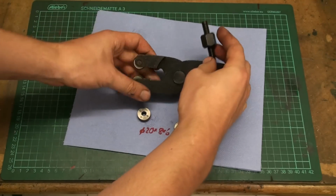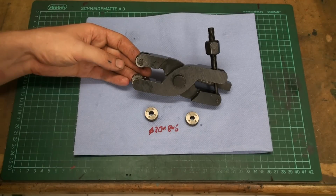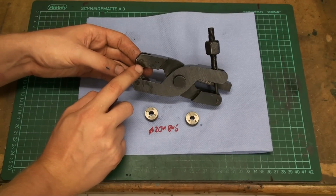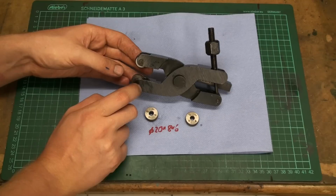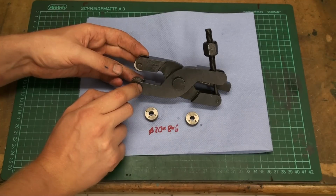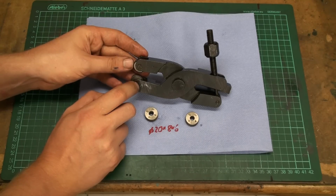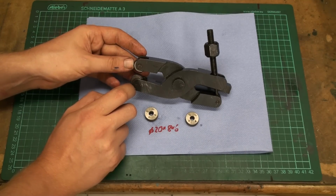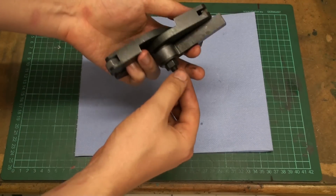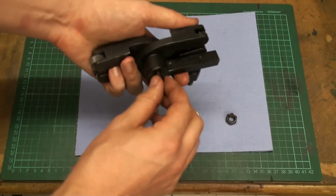The pins for the knurling wheels are pressed in, and they look like they're knurled themselves and then pressed in. Normally there would be no way to exchange these, but we will press them out or hammer them out, then we will remachine the bores and make axles for the wheels that can be changed without having to use a press. And also we're going to make a new pin, a new swiveling pin